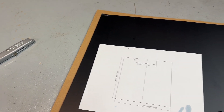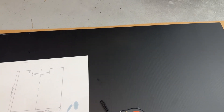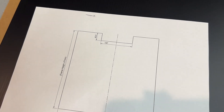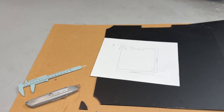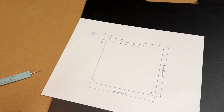If you are not familiar with cutting this plastic, it's wise to practice on a scrap piece. These boards were not easy to find locally, so take your time planning this. Measure twice, cut once. Start with a relatively fail-proof piece, such as the back panel, which only requires a square cutout. A hard surface underneath makes for a cleaner cut and minimizes blowout on the bottom side.